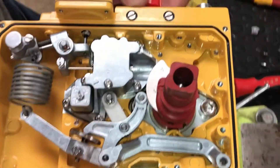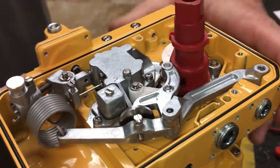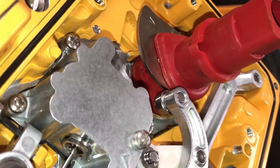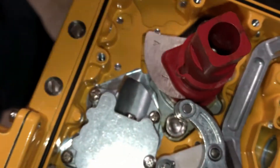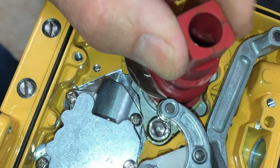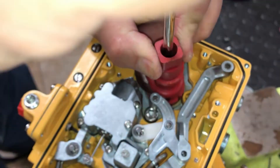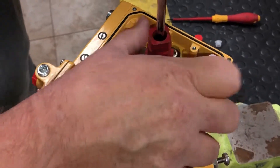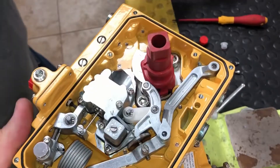Move this back and forth — go all the way down, all the way closed. You can see this is adjustable. What we want is to put our roller right at the bottom of this cam, so just barely rotate and it's right there at the bottom. When you get it there, tighten down on your clamp. You don't want any slack — right when that moves you want that roller to start up that cam.